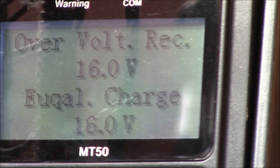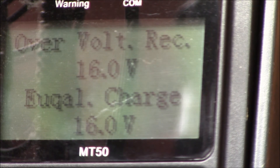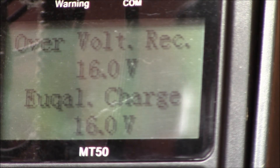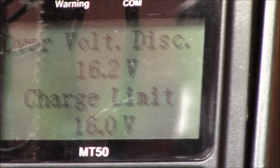I'm trying to keep lowering these numbers to avoid overvolting the power inverter, and I think I might have been overvolting the SBMS 120 and causing it to shut down. I'm trying to balance the numbers on the EP Solar with the numbers in the SBMS 120 to get them all working better together. The big limitation here is you only have 0.1 volt resolution on this charge controller, whereas on the SBMS 120 you've got hundredths-of-a-volt resolution — down to 10 millivolt precision.